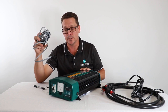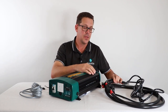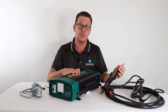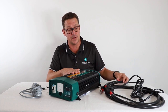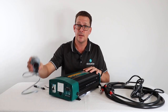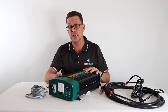To summarize the key installation points: install close to your battery, keeping cable length to around one and a half meters. For a 2000W inverter use 70mm² cable for 12V applications; for the 2600W inverter use 95mm² cable for that one-and-a-half-meter run. Use an isolator if storing your caravan to reduce standby current draw. Take care when shortening or making your own cables. And on the AC side — don't risk it, engage a qualified electrician to sign off and certify the work to ensure it meets standards.